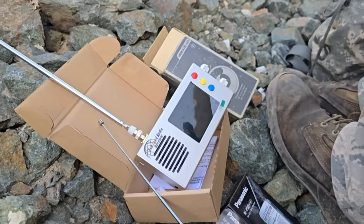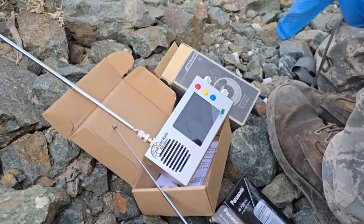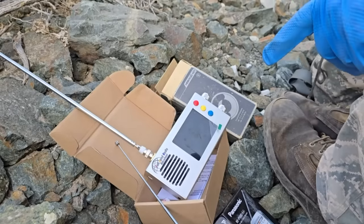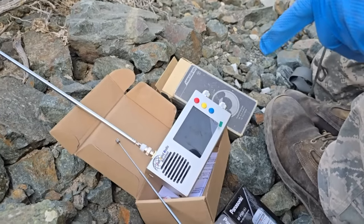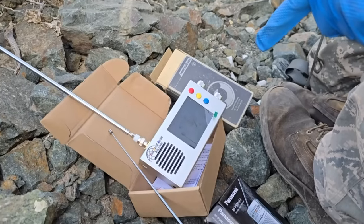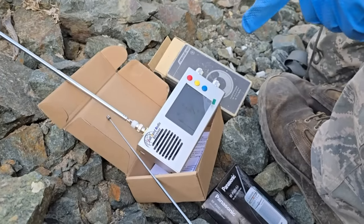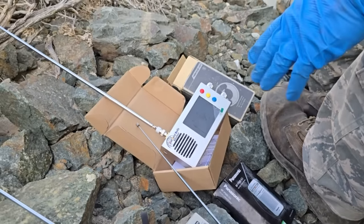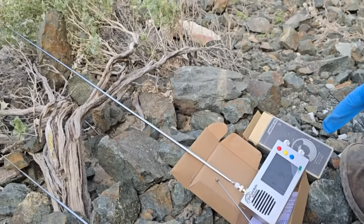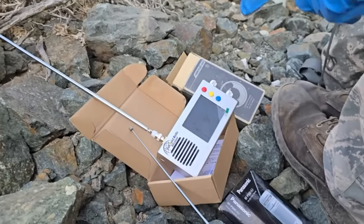And maybe put sideband decoding on it. Because that goes from long wave all the way up to what, 26 megahertz? Mm-hmm. Or 27. It really should go to 30. And that would be an awesome radio with just some software changes. Nothing's going to beat that, but it's pricey. It's like $160 shipped, but it's worth it. Performance-wise, like I said, the Russian SDR doesn't even come close to that thing.